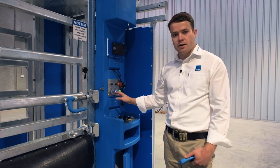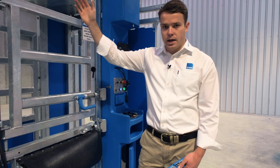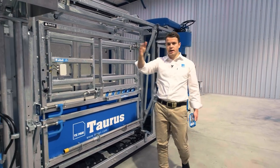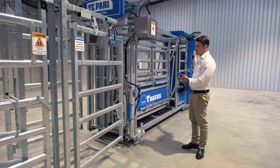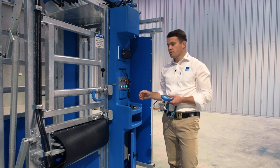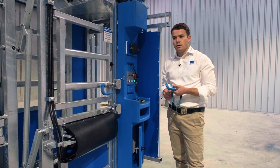The third mode is auto draft mode. This allows you to set your weigh scale indicator to draft on weight or tag information. In this mode as an animal comes in and closes the entry gate sensor, that closes the entry gate, and then based on the weight or tag information the crush will open the correct draft gate and open the head bale as the animal moves out and the weight goes off. The cattle crush will reset and another sensor on the drafting module will tell the crush the previous animal has left. The fourth mode is auto catch combined with auto draft mode, used when you want to draft on weight or tag information automatically and also require head bale access.